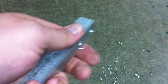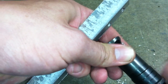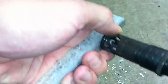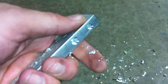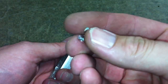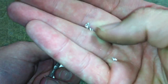I don't have it set very deep — that surprised me. Hold on just a second. I think I'm using the cage for the number 40 cutter. Let me try again. That certainly did it. What I should have done the first time is show you the chips. What I like to do in our machine shop is show our guys the chips — you can tell a lot by how the tool is cutting by what the chip looks like. This is a very fine chip, almost like aluminum foil, and it's pretty smooth.